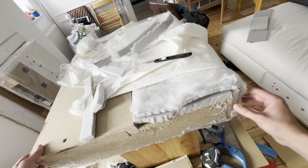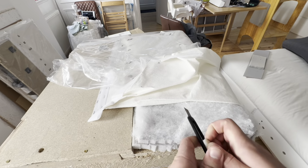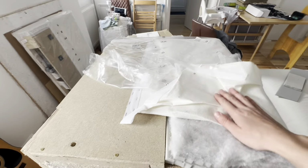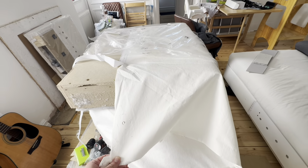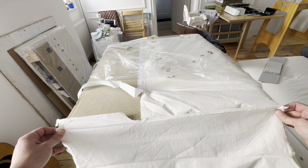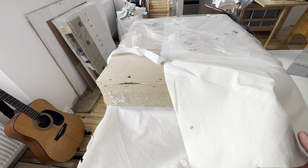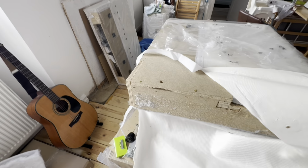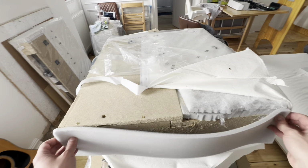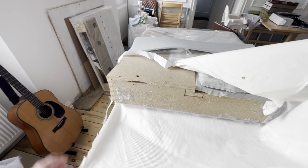Maybe we should. Good, that's nice and flush all the way around here as well, which leads us to the only part that I'm not too experienced in, but still a professional, of course. The way it was done before is that it was just brought to the end and the seam was here, if you remember, like this. Since we are not going to get a sewing machine out, what I'm proposing is that, after reinstalling the end sponge, we cut this so that we can staple it to the wood through the sponge.